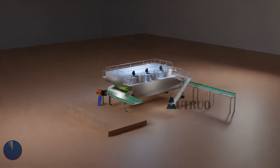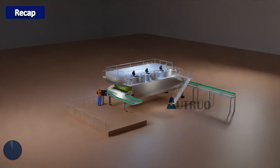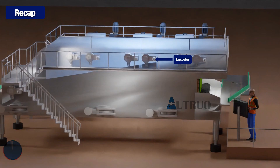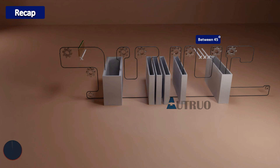Now let's do a quick recap. We started by looking at bottle washer operation, then looked at how water usage is minimized. We also looked at the engineering behind this machine — specifically the use of encoders and torque monitoring devices to monitor the chains. Finally, we looked at the role of transmitters in keeping the temperature of the bottle washing machine regulated. Hope you have learned something new today. See you in the next one.